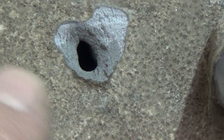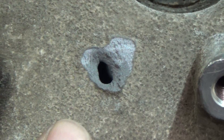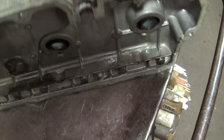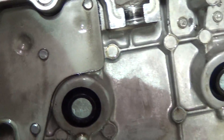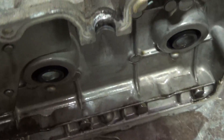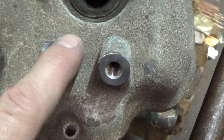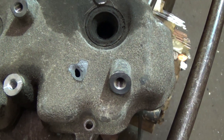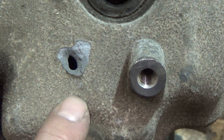I just want to know what all this beach sand or whatever is on here. If that's oxidation, my goodness, that's just crazy. I mean, if you look at the rest of it, it appears to be cast aluminum. I just don't understand all that oxidation on there. So what I'm going to do is prep it — just grind it like I normally would — and we'll see what happens.